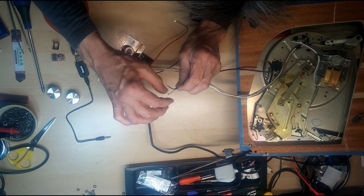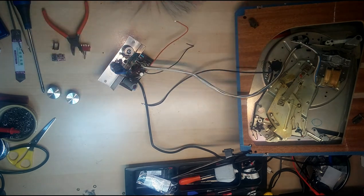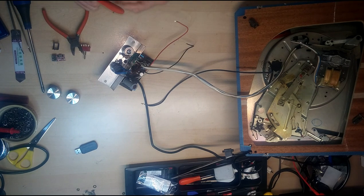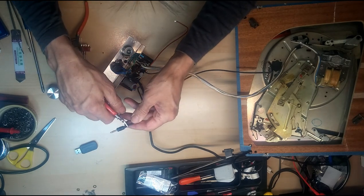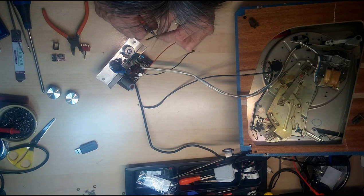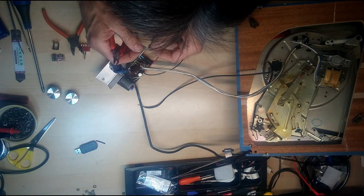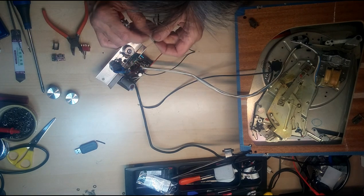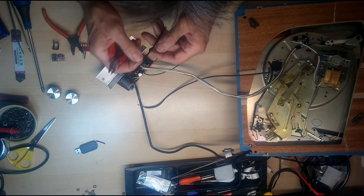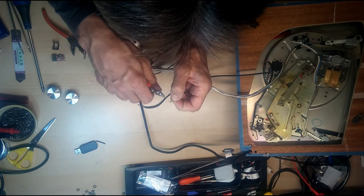Now that needs to go to one side of our switch. Here's our Bluetooth cable here, which we also want to use, so we'll take that off. We'll cut one end of this off, like so. And we need to expose the cores. Actually have three instead of a sheathing, which is kind of unusual. I assume the red and white are the two and the green's the sheath. I will check that out with a multimeter just to make sure.